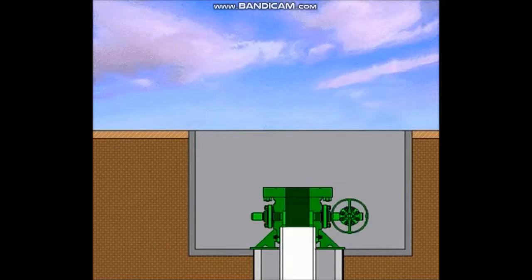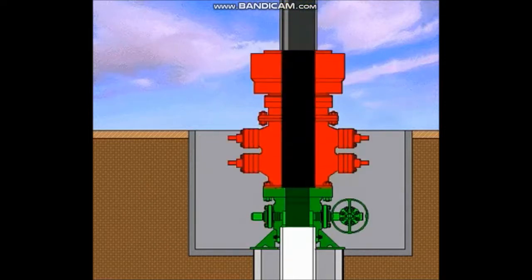When the casing head housing has been successfully welded and tested, the BOP system is installed, or nippled up, and preparations are made to drill out for the intermediate string of casing. To test the BOP system, the test plug is made up on the drilling string and lowered through the BOP system until properly located in the casing head bowl. Pressure is applied from above the plug and the BOP system is tested. Upon completion of the BOP tests, the wear bushing running tool is made up on the drill string and the wear bushing installed. The wear bushing is then lowered through the BOP system until located in the casing head bowl, and locked in place either by lockdown pins in the casing head housing flange or by lockdown pins located in a lockdown flange. The running tool is then removed and the drilling operation can resume.